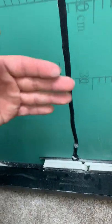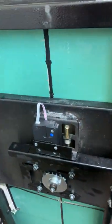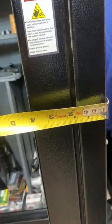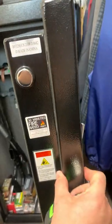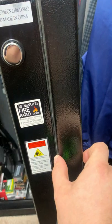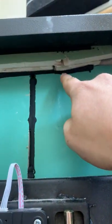All you've got are these bolts really holding the arguably second most important part connected to the most important part of the safe, and that little bit of wiggle caused it to fail. Looking at the door construction: this is the sheetrock, just a sample piece to keep it in place. There's a lot of dead space in here. They advertise the door as 4.25 inches thick, but measuring it — that's barely four inches, not even four inches. This part is the actual door, and it's 14-gauge thin steel, then you have the fireproof sheetrock, and then the space for the lock and internals.